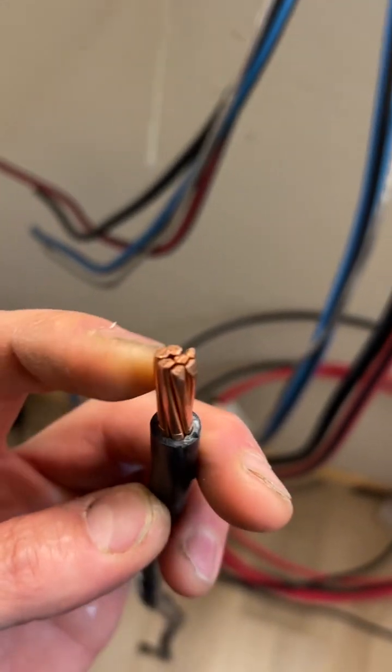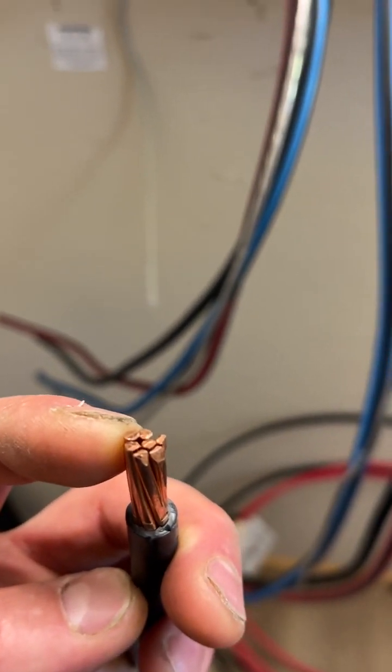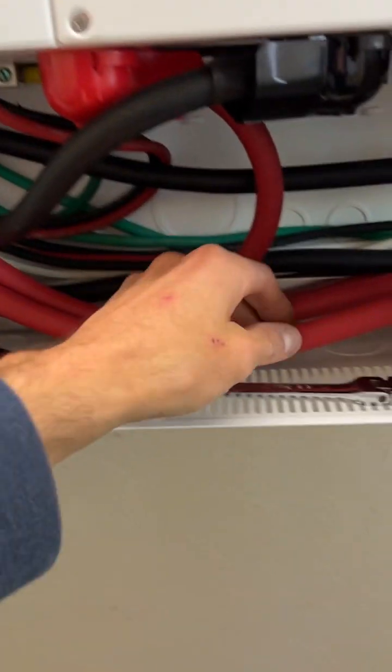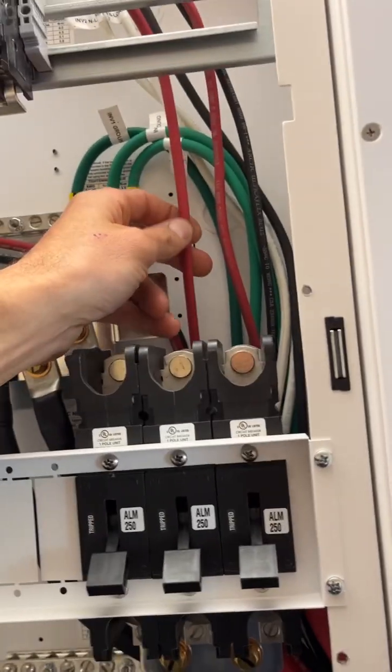Oh, the wire size. Because it's not fine stranded wire, it's fairly heavy duty strand. Like this is only 7 strands, sorry. 2, 4, 6, 7. Yeah, this stuff just compresses. It doesn't split out and separate like fine strand. Like all of these are very fine strand. These guys, Polar Wire, they make a fine strand. I think there's like 1,500 or 1,700 strands or something crazy inside this. It's awesome. These have like 700 strands. So the strands are really, really small. Thus, they go to ferrules because you're just going to break the little wires when you start to compress down on them. When you run something big like this, it just compresses.